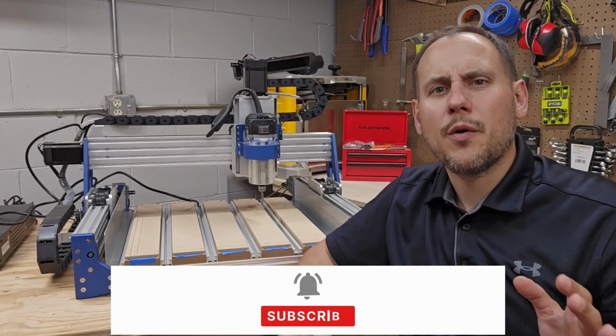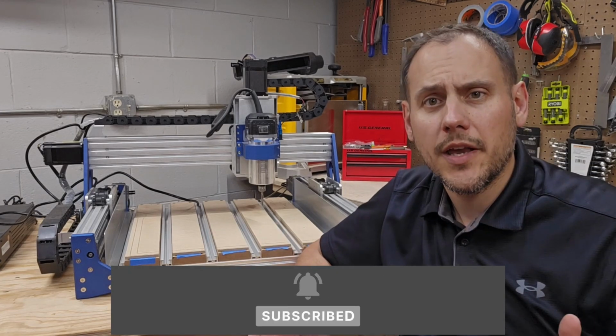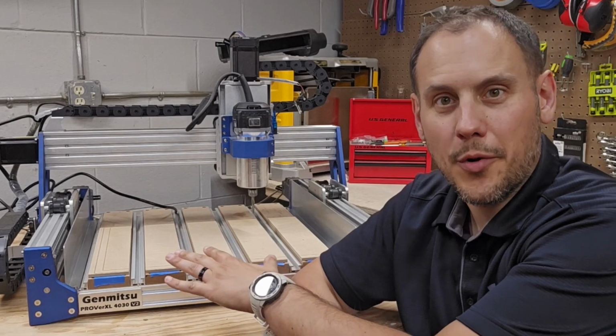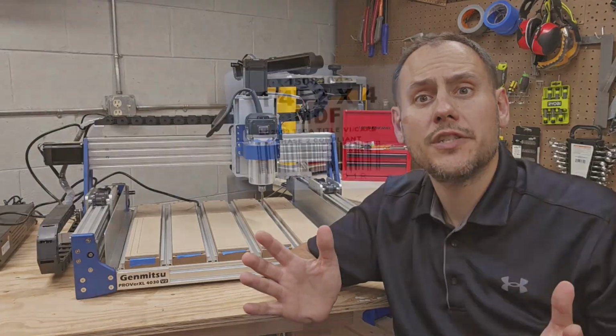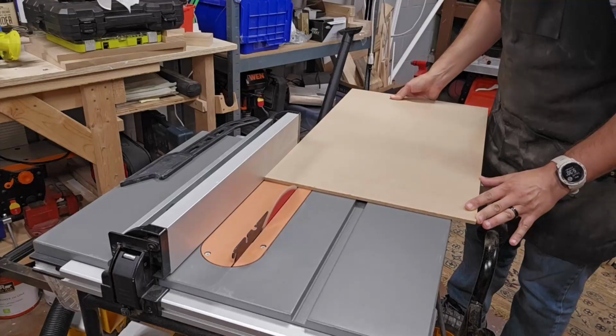Now, it wouldn't be an issue if my working material was always on the cutting area, but I've done projects where this wasn't the case. So that's why I'm going to create a spoil board on top of the spoil board. I got some 1/4 inch MDF, now let's cut it down to 12 inch by 2.5 inch strips.